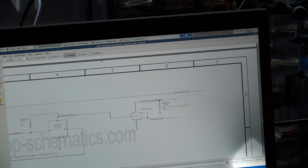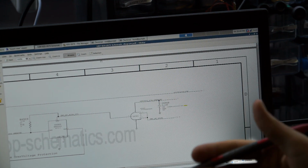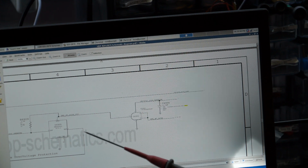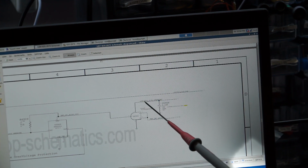That also is responsible for creating the 12 volt system power that everything runs off of. So most of the things on this board are created off of that 12 volt line. So that chip I'm pretty sure is fine. It's creating the signal I need, and it's even creating 12 volts. Next, I check over here, and I have 3.42 volts at the chip.